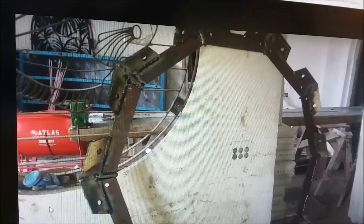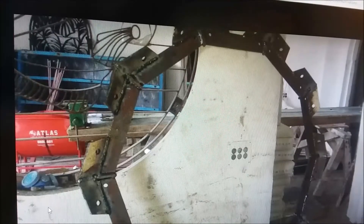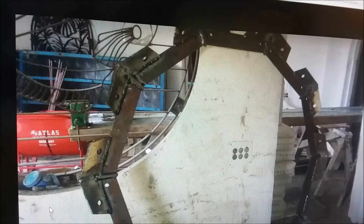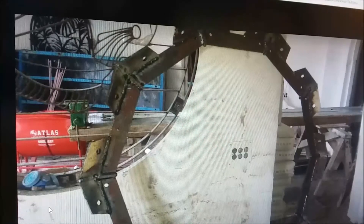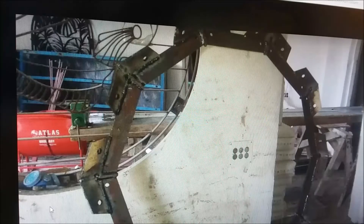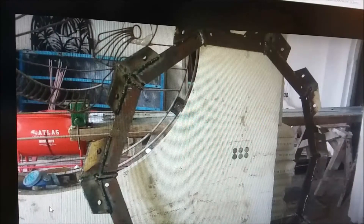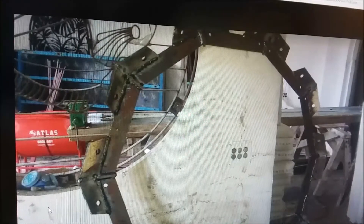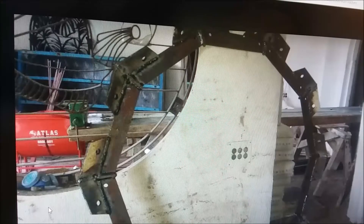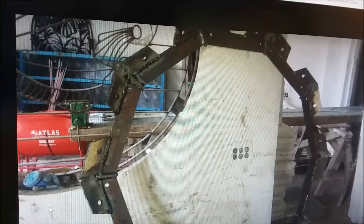This is showing we hadn't welded the bottom of all the joints. There are grills going up with slots in the ceiling for the whole-house fan exhaust — 10 slots about eight feet by two feet around the room — and those were never finish-welded. He ran out of welding rods. I told him to go ahead and put this thing in the middle while we have scaffolding up, get it touched with a grinder, clean the rust, put two coats of paint on it, then hoist it up on the work table in the center of the room. We'll put threaded rods down, wind it up with nuts using three rods to bring it up, then cut those and use the remaining 14 rods.